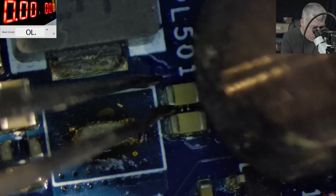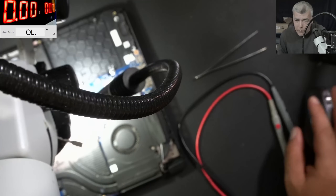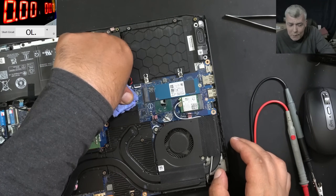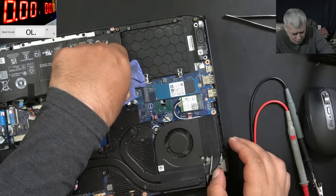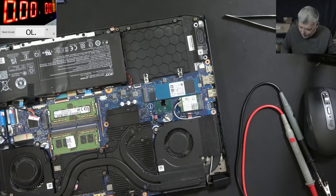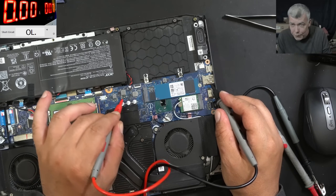When I say output capacitor, this capacitor is working at very low voltage. We remove the capacitor. Let's cool the area. What do you mean, replacing the capacitor? There are like four more capacitors. That shorted output capacitor — this is crazy. Let's check now for short. Do we still have a short? Ground here — nothing. Infinite resistance. The short is gone.